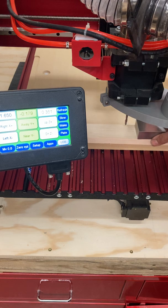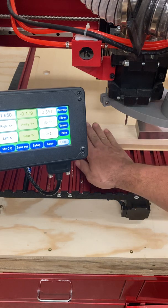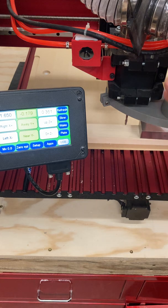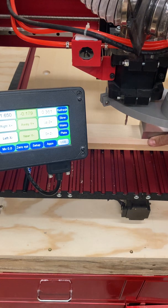It's also very helpful to make sure that your piece of stock is nice and flat. If there are ripples, waves, or anything else, then you should probably flatten that piece before you start doing the Z offset. Or you could end up with differences in height — maybe you won't cut through the whole thing at the distance you want. That is another important part of this.